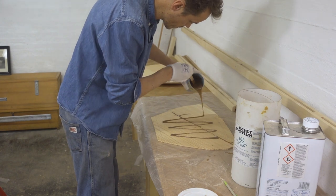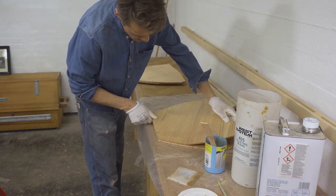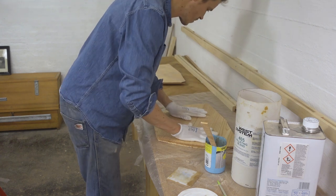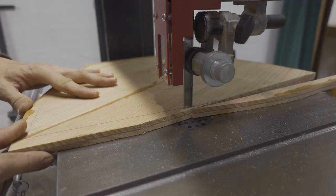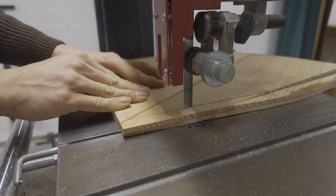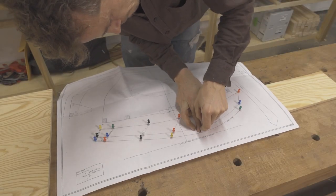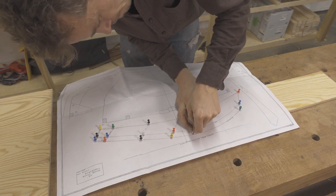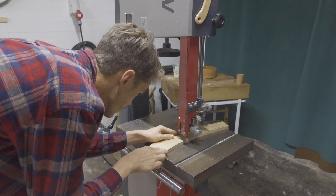Now I'm building the watertight bulkheads. These bulkheads are made of two thin layers of wood that are glued together with the grain running diagonally to each other. This makes for a very strong panel and it makes it very dimensionally stable, much like a sheet of plywood. Finally, I'm building the stems. Again, I'm making a pattern by pricking through the full-size drawings that are included in the plans.